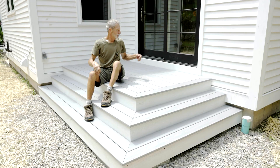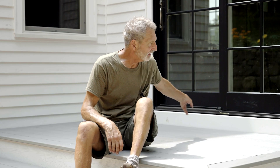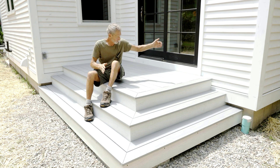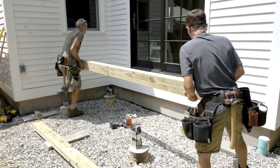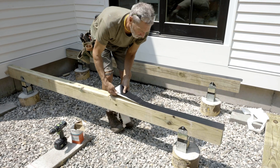On this deck, instead of attaching a ledger board to the sheathing — which would have required removing the siding and trim boards, and because there's a rain screen in addition to the siding we would have had to bury that ledger deep in the wall — we simplified it by putting in an extra pair of footings and an extra beam, making this a freestanding deck.